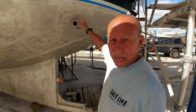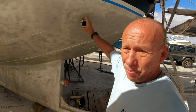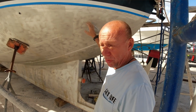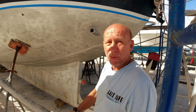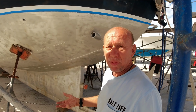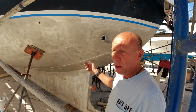We have the port side stern thruster, and I've designed a cap that connects onto these thrusters so that we can connect a fire hose. So if we need to go down below and do any type of cleaning, silt removal, or any type of high volume, high pressure water work, we have the secondary use of the pump.